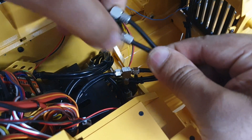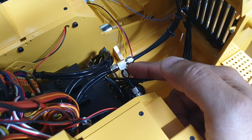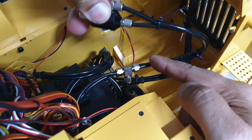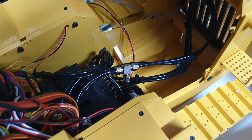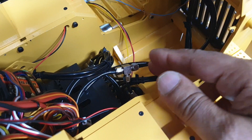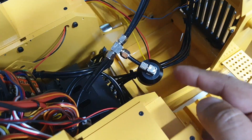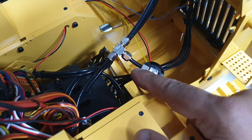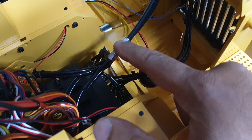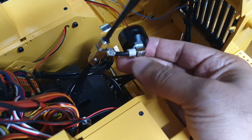Since it creates more pressure and you have your pressure reducing valve on this line, it's now reading the pressure in this line. So that's the basic functionality of where it is set up. We have spliced the line — we put a T-section in there and it's got a right angle fitting. So there's a T-section and then there's a right angle fitting that goes into the pressure transmitter.